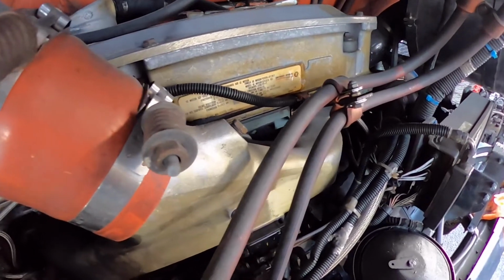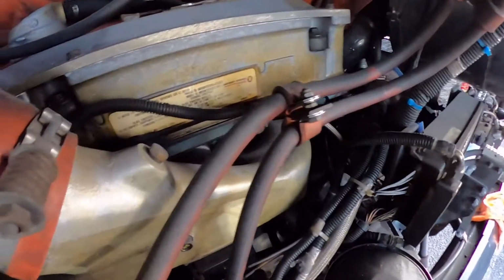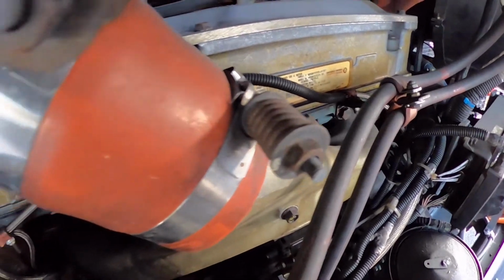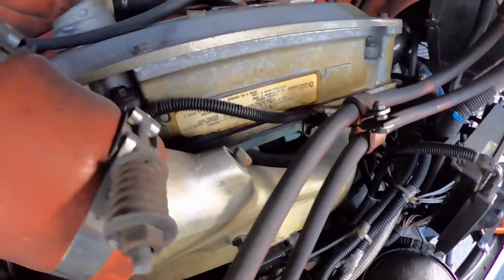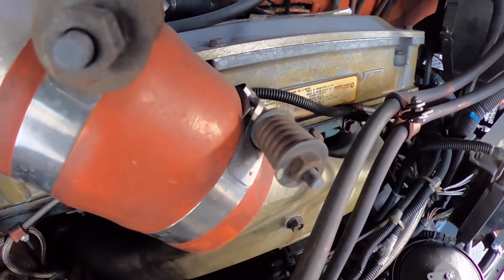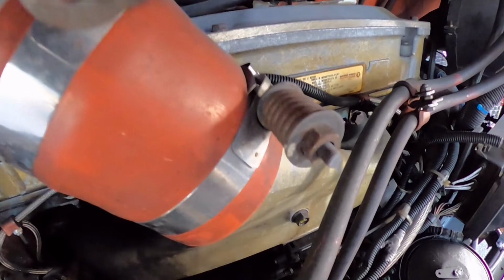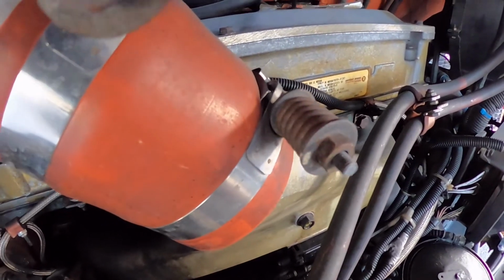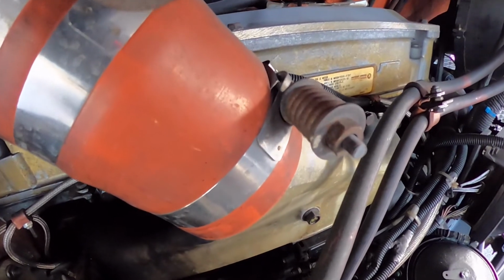And yeah, so I'm taking off these reservoir lines, which go to your tanks. What I'm gonna do is take these out and do some testing. As a matter of fact, I'm just gonna take all of these out. You've got your unloader lines, like this one down here is an unloader line. And we're gonna start the bus with all of these running.